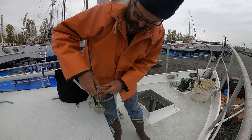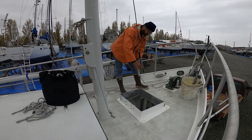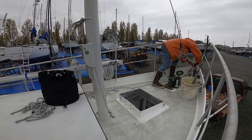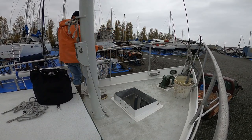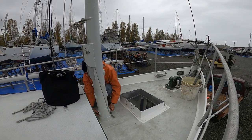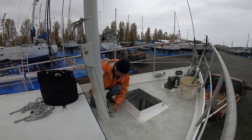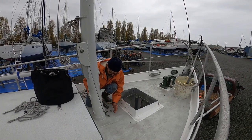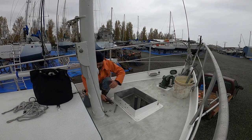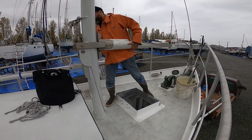When I start to lower the mast down, you'll notice that I've welded ends of heavy plate, closing off those oblong holes that resulted after the slices. This means those bolts actually pass through four skins — two skins per section. Here I'm going to drive out the last of the bolts. I've got the forestay temporarily rigged with a four-to-one block and tackle and I've got tension back on it, so now I can drive out that last lower bolt.